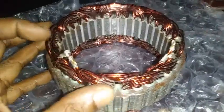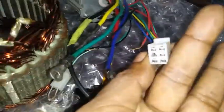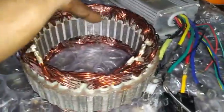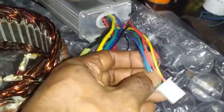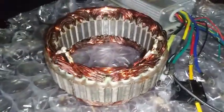This is what's going to increase your torque load and speed. The speed of the motor will depend on the controller and making sure you have a hall effect sensor. You're going to have three sensors for monitoring a 180-degree position, and two of these wires are going to power the sensor, which will relay information to the controller based on where the rotor position is during high-speed rotation.